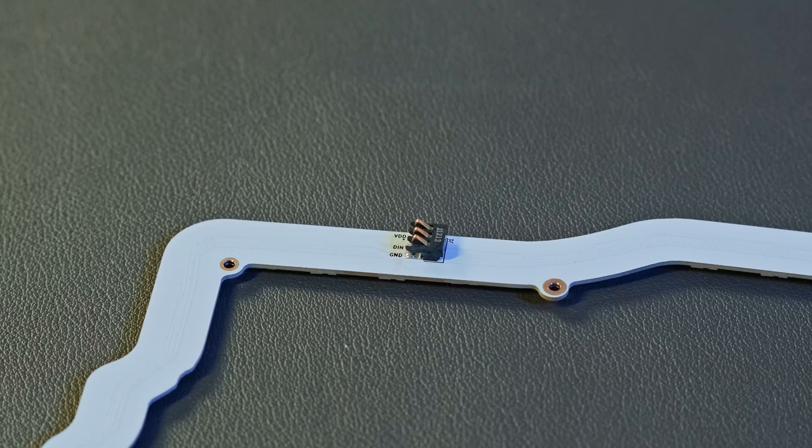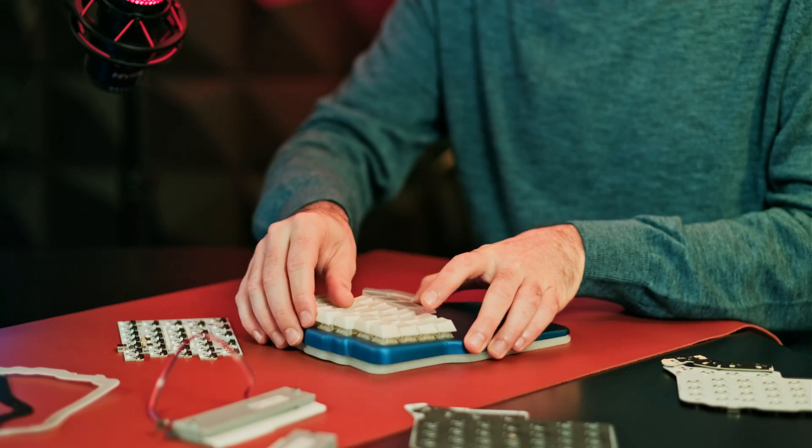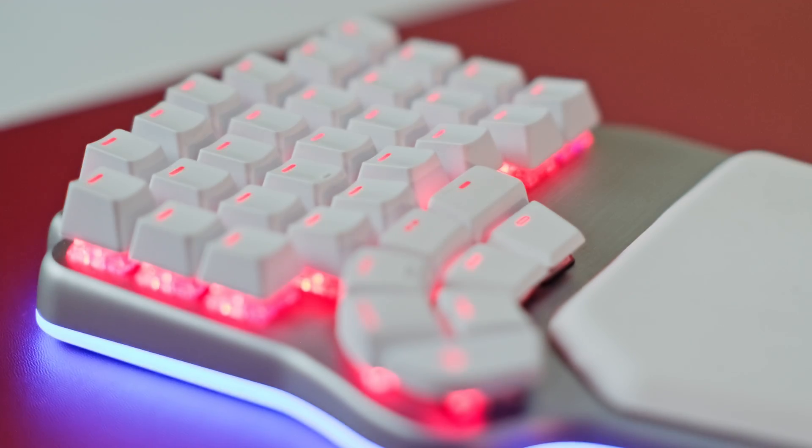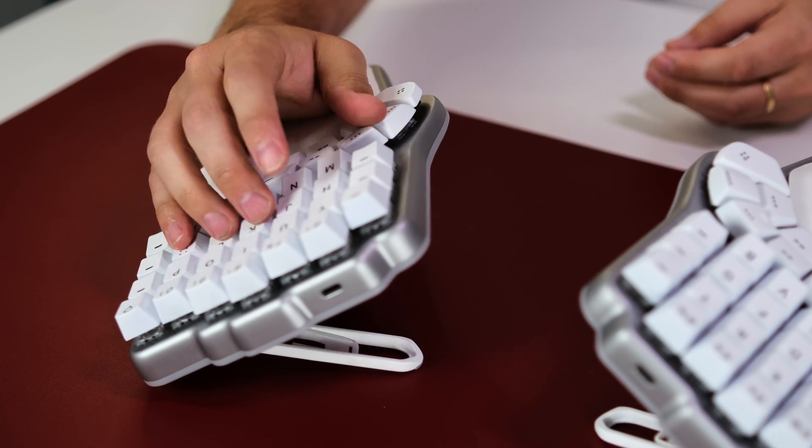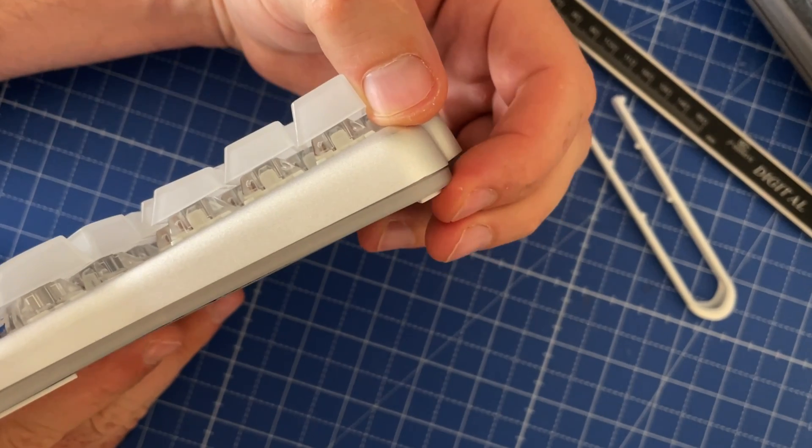Another interesting thing I'd like to point out is that we replaced the cable connection between the underglow and the main PCB with a pogo pin, so it makes it much easier to connect the underglow to the main PCB — just putting it in contact and it's totally connected and working. That way, there's one less cable to worry about and we reduce a lot of potential quality issues. Finally, while testing the tenting legs, we found that keyboards with underglow were more stable than those without. After closer examination, we realized the underglow PCB added rigidity to the edges of the keyboard and base, which prevented micro movements on the legs and the subsequent wobble. The solution? Add a fake plastic PCB to the keyboards without underglow. We're still figuring out exactly what type of plastic, but you get the idea.